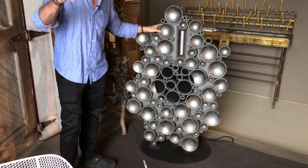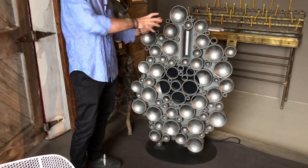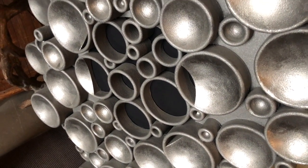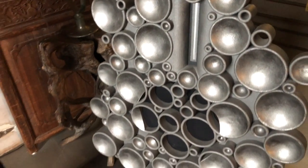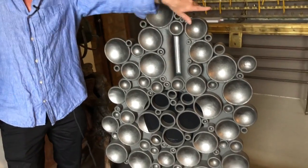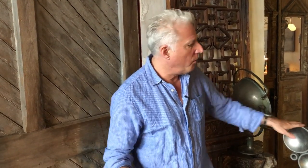They are cast iron — a quadratic diffuser. The shapes, the size, and the form are a quadratic diffuser. You see those in studios on the walls and ceiling; they're designed to break up sound waves, to diffract and diffuse the sound wave. Here they function that way as the sound launches from this wide baffle surface — unlike speakers today, which are all these narrow things, which is very bad. Then the sound wave sees these shapes and diffracts. At 500 pounds per side, this is not vibrating — inert. What you have is well over 100 dB sensitivity at one watt, one meter — an ultra-efficient, open baffle speaker that is incredibly lifelike.